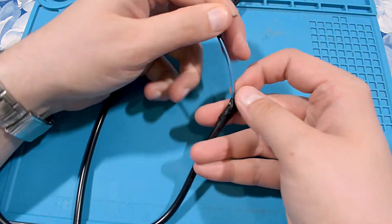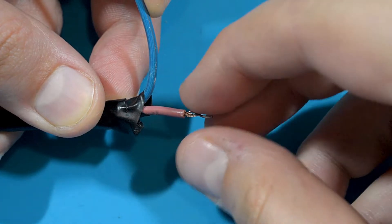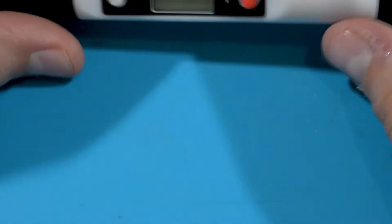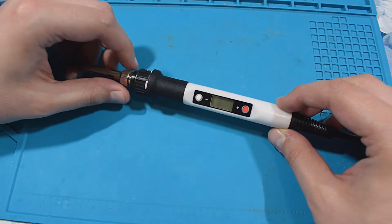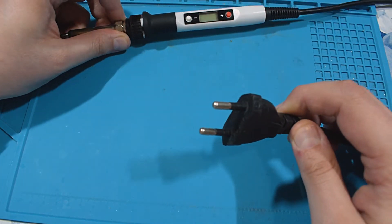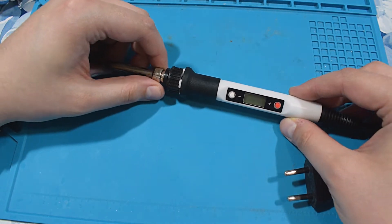I disassembled the switch and I remembered - yes, they have these crappy wire gauges. It's barely a wire gauge; I mean I made it into a solid core wire by soldering it together. So I'm going to try to do two things today: disassemble it, replace the cable with a better, thicker gauge, and hopefully ground the soldering iron, because as I've mentioned before it's not grounded and I don't really like that.